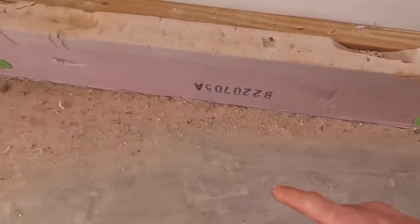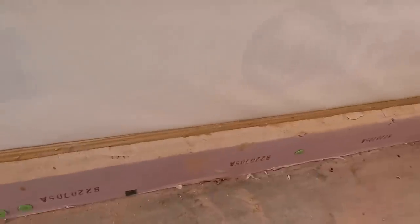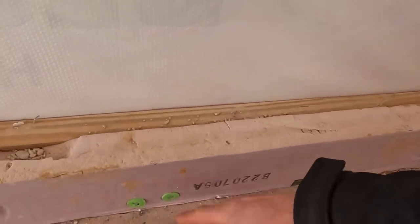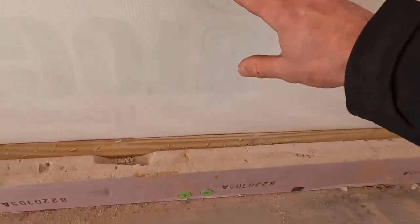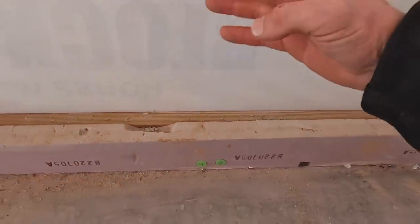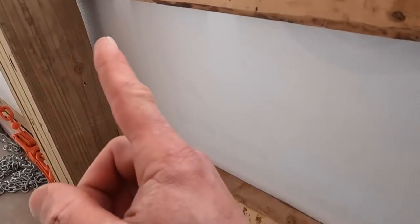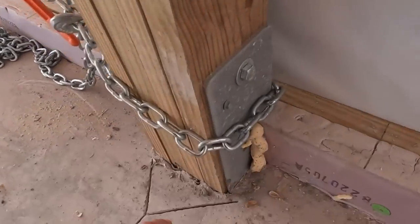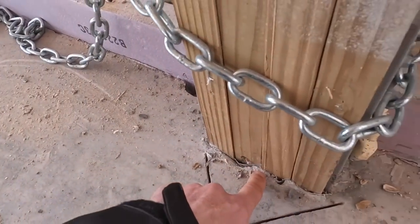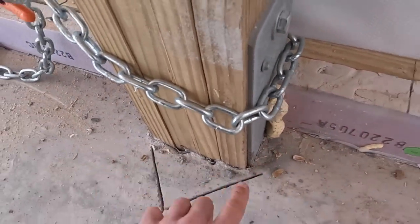And so we'll put our interior girts on that will run from this column over to there, and then the spray foam will get sprayed in here, attached to this, come back and fill all this. So you get a thermal break all the way up, and then behind the columns will get filled with spray foam. And then our plastic goes around this post here, concrete gets poured around this.